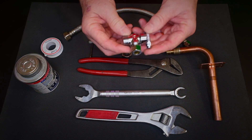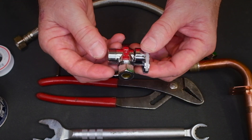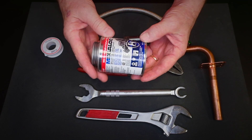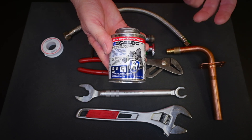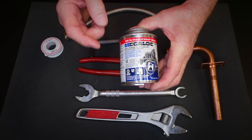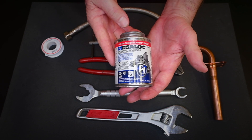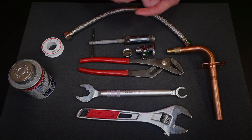This is a quarter turn stop — fast, efficient, and long lasting. At Milestone we use Megalock pipe dope, which is a great product. There are lots of others: True Blue, Pro Dope, T1, T2, Rector Seal — all great pipe dopes. The main reason we use Megalock is that if you get it on carpet, tile, or a wall, you can clean it up right away and get it off. Other pipe dopes tend not to come off things even right when you get it on them.